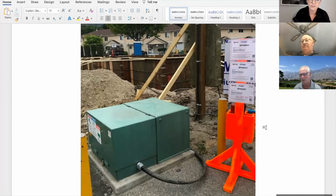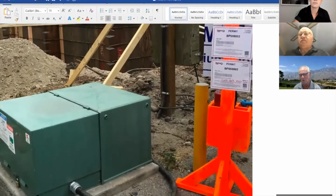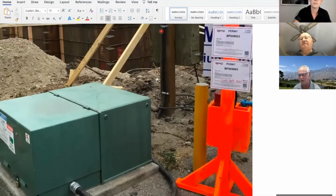I like the way the cable has been buried between the pad mount and the base of the 6x6 in the background. You can see it. So, you know, they took the time. So if a tradesman should walk through there, or if they stack some material in there, the cable is fairly well protected by the earth that's been put in there.